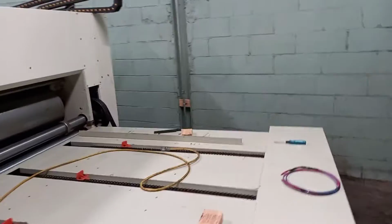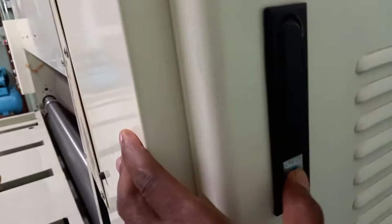All right, and the outs, the pipe right there, I ran it down over here, and put it right here with the BX coming in. Okay, same here. The BX brings it right here, that's the wires. These three wires will come to those terminals right here. You can see L1, L2, L3.